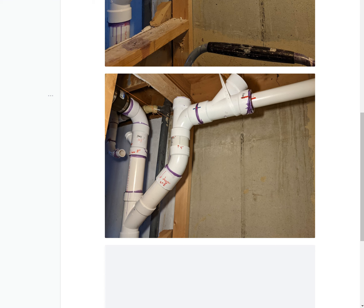In this case, I did this section first. I don't try to dry fit everything all the way because what will happen is one end will not work. So what I try to do is do this piece first — try to do one first and see how things line up. Use a throwaway piece of pipe and then measure exactly how much you need right here. That's how much pipe you need, so you make that cut as well. You can note the size and write it down on it. This one is going to be five inches, so I know how much it is going to be.